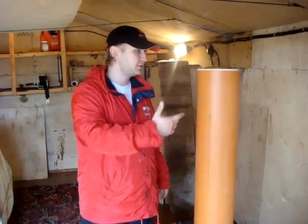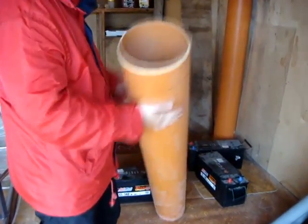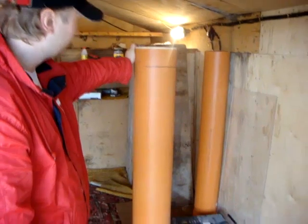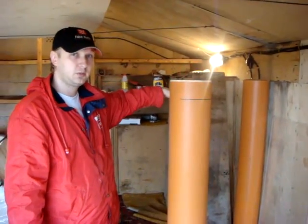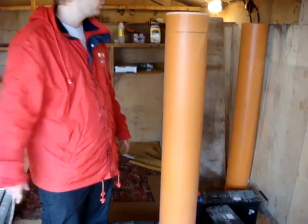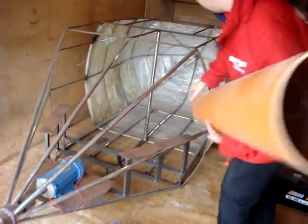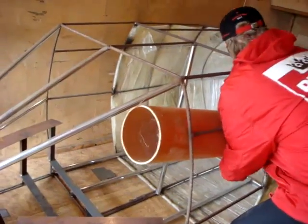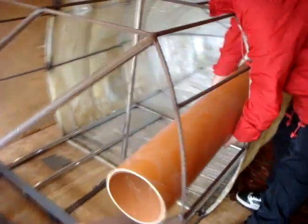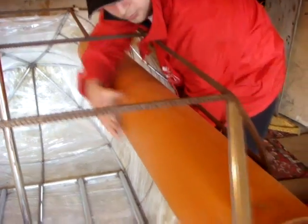As for operation of the submarine itself, it requires ballast tanks. This is what I have — basically industrial pipe. What I did is I cut it in half, because it was three meters long. I require six of them, because two of them are capable of holding 200 liters of water or air. The tubes would be placed here on the side, heated like so in this part, and six of them would be sitting one on top of the other. This is basically where the ballast tanks would be placed.